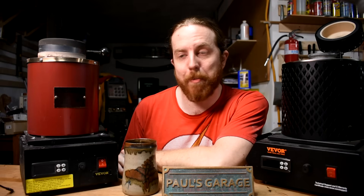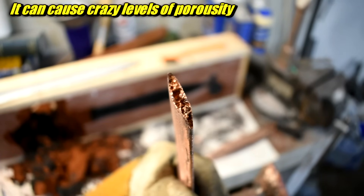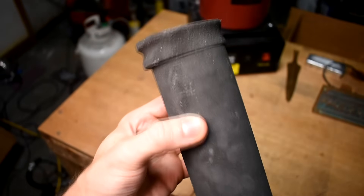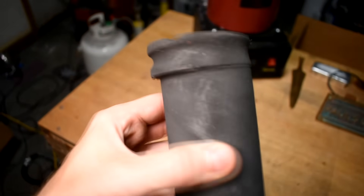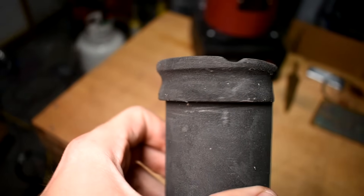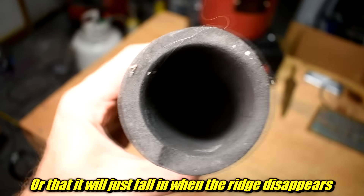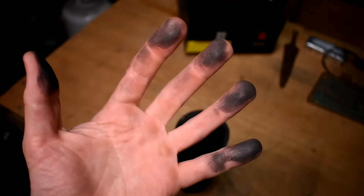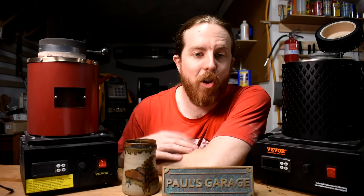A reducing atmosphere is kind of nice — it stops your bronze from oxidizing really bad, and copper alloys are really bad for that. But it also means you're literally losing crucible to the air while you're running it. Here's the first three kilogram crucible I got and I've since stopped using it. It's super worn out, looks awful, pretty thin in places. It's not broken, but I probably shouldn't use it anymore. This two kilogram crucible broke on its maiden voyage, so it's not that.